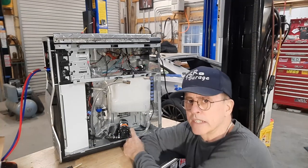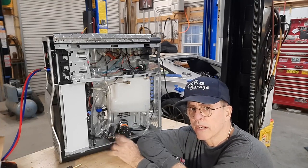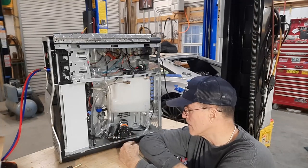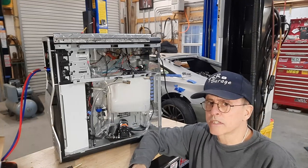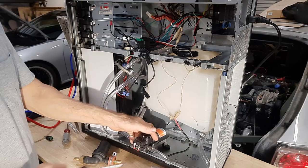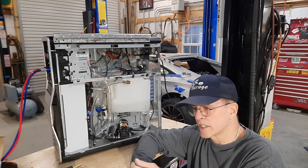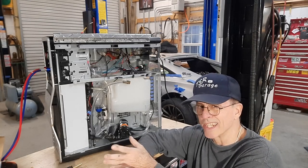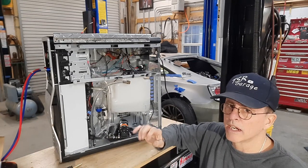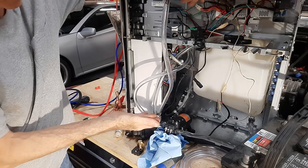The reason for the accumulator is this pump on its lowest setting — it's a 35 psi pump — pulses from 25 to 35 psi. I had a gauge on it at one time. It pulses very rapidly. It moves enough water, but hear how that pump's stuttering? Unless you turn the pressure way up, and then you can hear the pump straining and there's no need to put that much pressure through the line. So with the accumulator, it keeps the surging of the pump a little bit lower. The idea is this has to be airtight, and this is just a way for those pressure pulses to bounce.